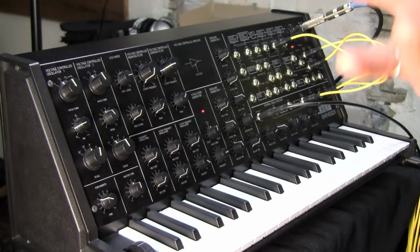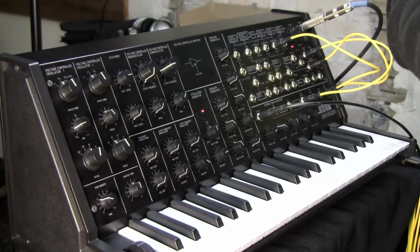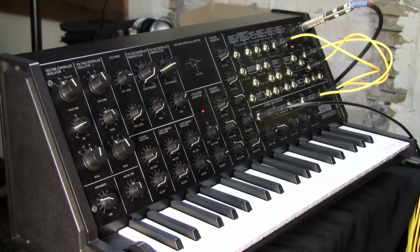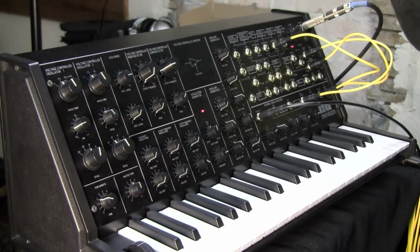Basically, and you're not going to see this in very many places, especially in production model vintage synthesizers or even synthesizers now, or really synthesizers ever. That's not true. There's probably an example of it somewhere. But what the external signal processor basically does is it takes an input signal, identifies its pitch and its amplitude, and converts the pitch and amplitude to voltages, which it will send out to different parts of the synthesizer. That's amazing. Let me say this again.